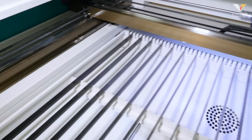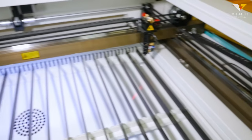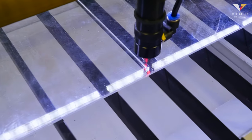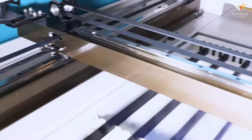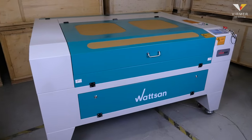The reinforced gantry endures most of the load during operation and significantly affects the durability, accuracy of the machine, absence of vibration and speed of movement. Made of 5 mm thick aluminium up to 7 mm thick in the corners. It has additional stiffening ribs to ensure durability.